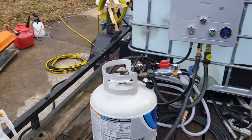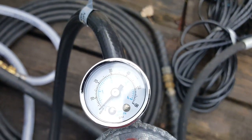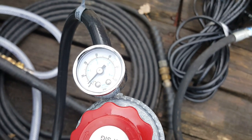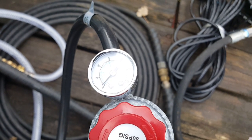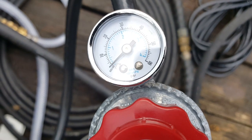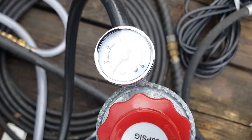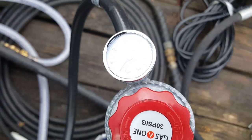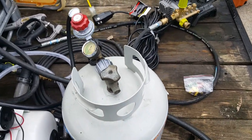When I was first installing this, the gas regulator goes up to about 30 PSI. I had it at 10 PSI and it just wouldn't ignite — I could smell the gas but it wouldn't light. I kept turning it up to 30 PSI and it still wouldn't light. It was also windy that night. I finally figured out it needed to be just a couple PSI — very low pressure — and then it lit right away. I recommend getting a regulator if you're looking into this setup.